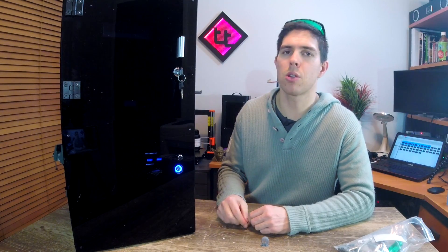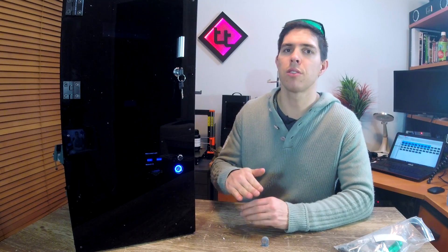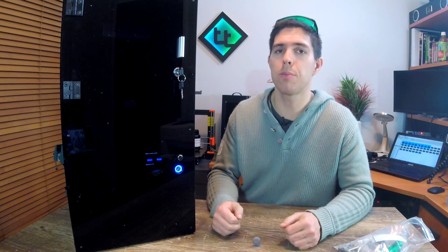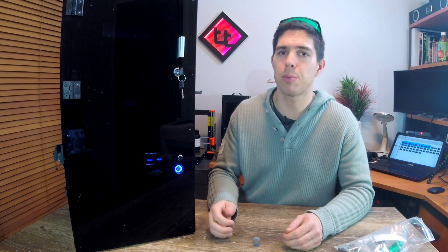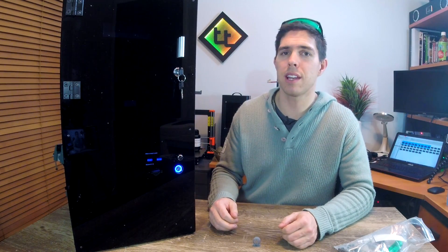As you can tell from this first ring, the result was perfect. There is a calibration print you can do that prints a little pillar in each corner - you measure with accurate calipers and do fine adjustments of the nuts to raise and lower the bed until all corners are uniform. Behind me I have a Wanhao Duplicator 7, and this first print came out perfectly whereas I didn't have the same success straight away on the Wanhao. Whether that's down to the printer, or me, or a combination of both is hard to judge. What's safe to conclude based on today's experience is that the assembly, calibration and first print on this machine is pretty good out of the box. My initial impressions are great - we'll see if that lasts as I put it through a more detailed review.